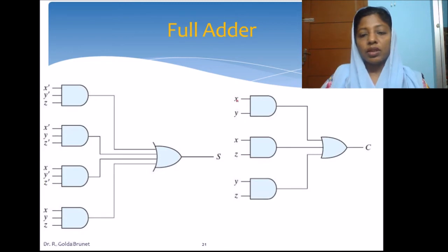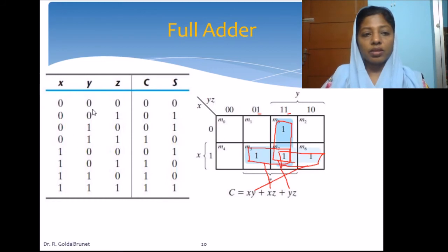That is one way of implementing, but the preferred way is using half adders — a full adder can be realized using two half adders. That is how we computed the truth table as well: we added x and y first, then added the resultant sum with z. The sum is a single bit output of one half adder, which we then add with the next bit z.